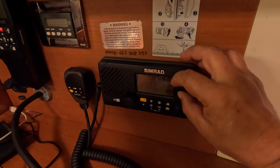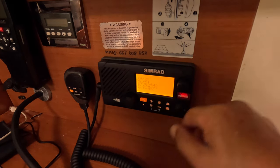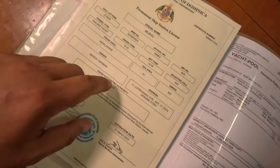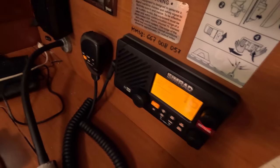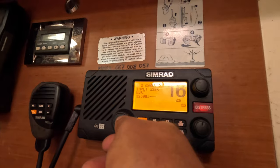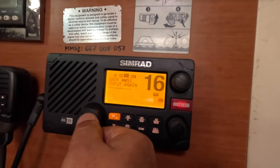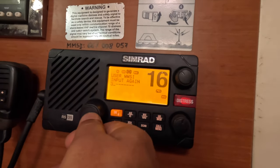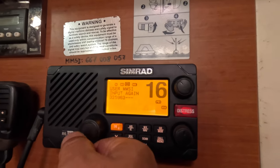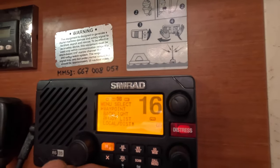In the service menu there aren't many options. What we need is to clear the MMSI number — just press 'Clear MMSI.' You can also do a full reset of the radio from this menu. Now turn the radio off and back on — it will beep because DSC is disabled with no MMSI programmed. Open your boat documents, find your MMSI number, and use the large wheel to input it. When finished, press 'Store.' The radio will ask you to input it a second time to confirm — repeat it and if it matches, press 'Store.' Your MMSI is now programmed and you can use the distress button.